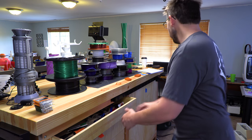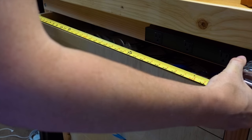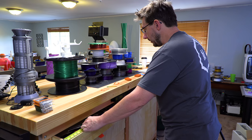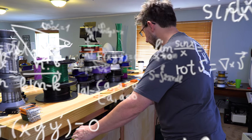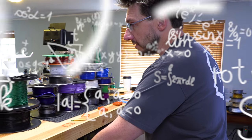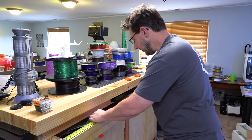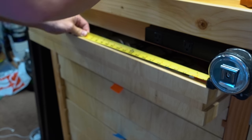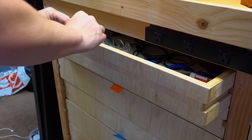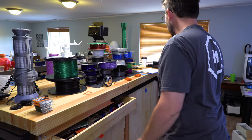Let's take that off, get our tape measure and a pencil, and measure across to find center. It is 33 and 7/8ths across, so half of 33 is 16 and a half. Half of 7/8ths is 7/16ths, so 7/16ths plus 8/16ths from the 16 gives us 16 and 15/16ths as the half point. Here's 16 and 15/16ths — it's going to be right there. And now thanks to my little template I can put it right here, that tells me where center is, and then I can mark where my drill needs to go. Time to drill.